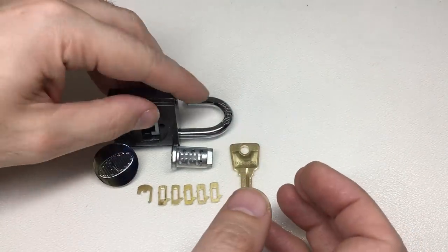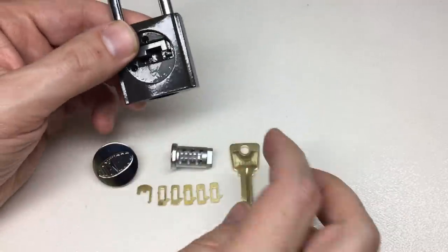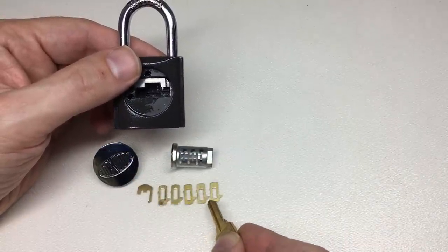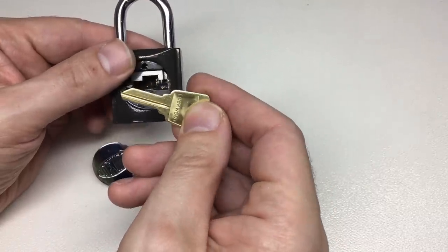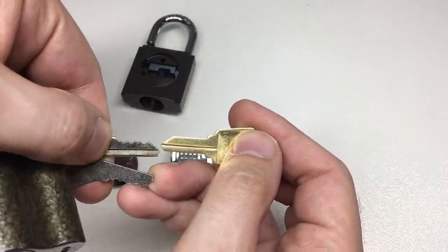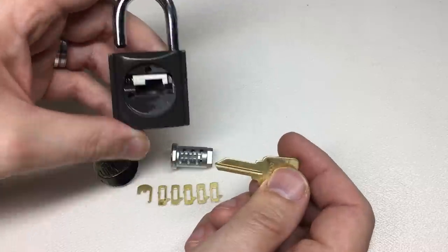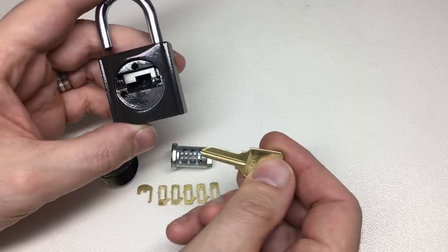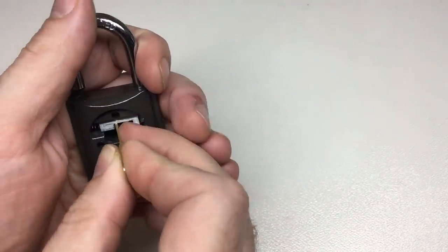Let's have a look at making this lock. For those of you only familiar with pin tumblers, you'll have a better idea of the differences. This is a zero-bitted key. You can get wafers which have different cut depths, meaning you can have different bittings on the key — much like pin tumbler keys. In some ways they work just the same, except they don't have drivers; they really just work off the interaction between the wafer and the key itself.